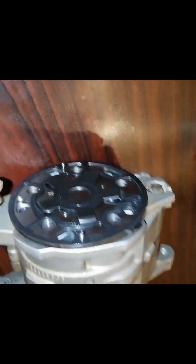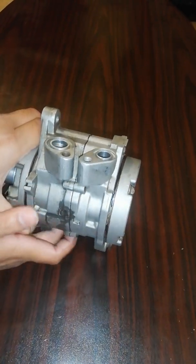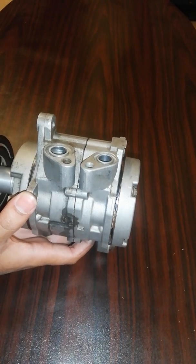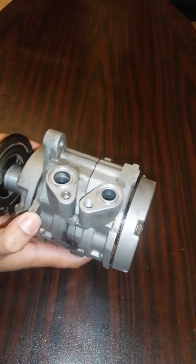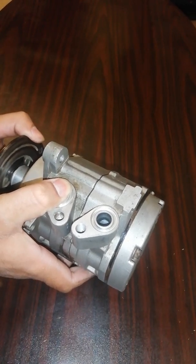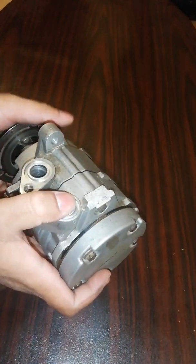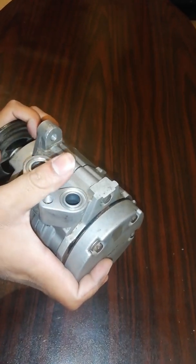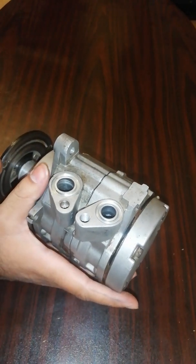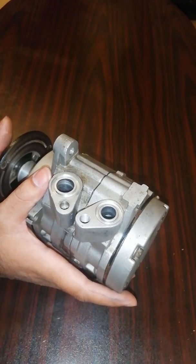The last step is placing the cover on both sides of the compressor. I have completed the full assembly, except for the clutch part, which I will show in my next video along with the gas charging procedure. To take a compression test, place your thumb on the discharge port and make three to four turns — this will make a pop sound. The same goes for the other port. This ensures all pistons are making enough pressure in the chamber, which is a positive sign.